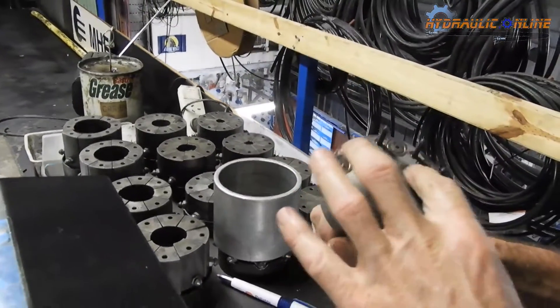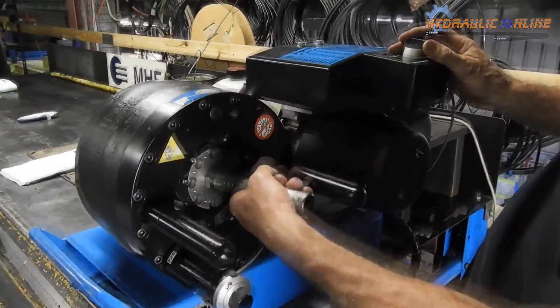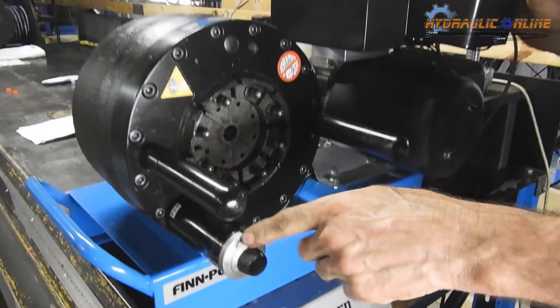I'm going to leave the 19 as magnets that grab the metal. What I'm pointing out here is a micrometer adjuster. When we manufacture hydraulic hoses, we crush or crimp a steel sleeve onto the hydraulic hose which has been pushed onto a steel hose tail. We're crimping a 3/8 two-wire hose and the setting for this finished hose is 21.9 millimeters. I'm going to show how we adjust this to repeatedly crush or crimp down to 21.9 millimeters.